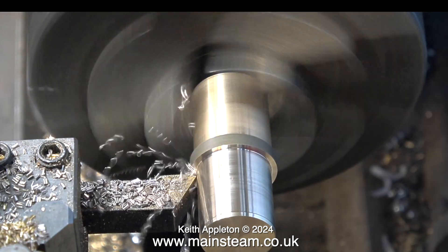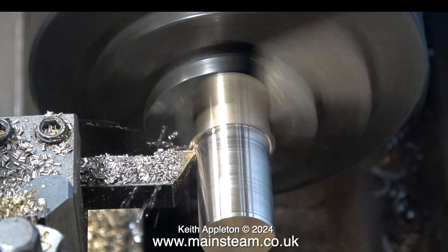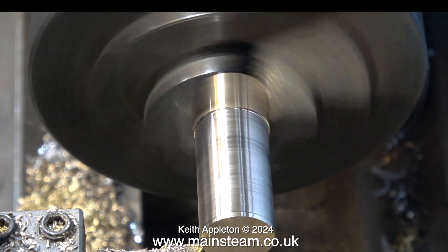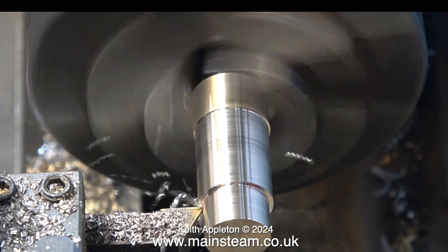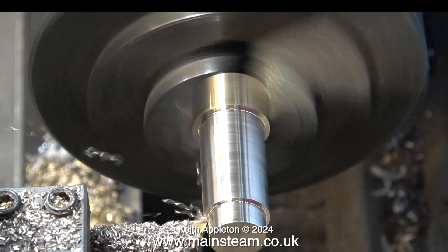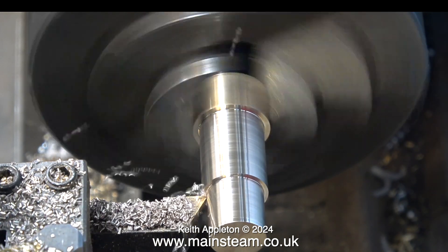I have a recommendation: if you're going to make your own steam fittings, make them out of phosphor bronze, not brass. In a steam boiler application you can get problems with brass fittings — it's something to do with the zinc content of the brass, and over time they can become brittle. I've actually seen this on very old steam engines. On screen I'm turning down the phosphor bronze to half an inch in diameter.